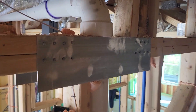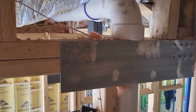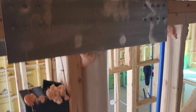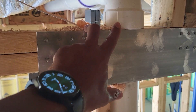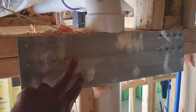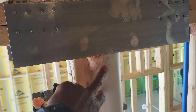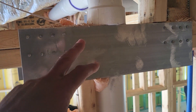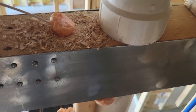You may also run across one of these — these are the larger plates, larger Boca plates or larger metal plates. You have a three-inch line running through a top plate. This particular top plate has been compromised with a three-inch running through it. These larger plates are used mostly for reinforcement to reinforce that particular top plate, and they are also used as a nail guard where they extend down two inches as well. So when a top plate has been compromised to the point where there's pretty much nothing else there, you have to come back with a larger plate.